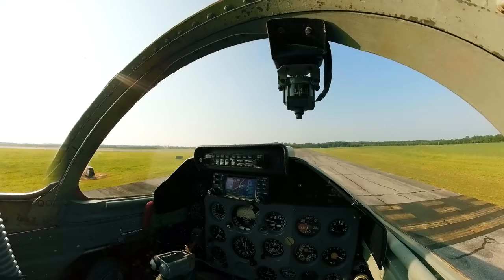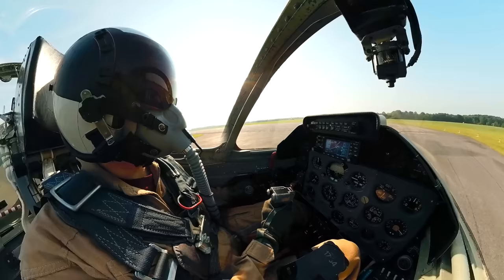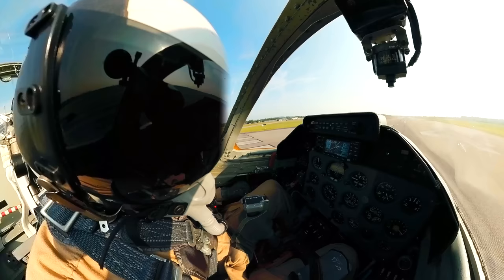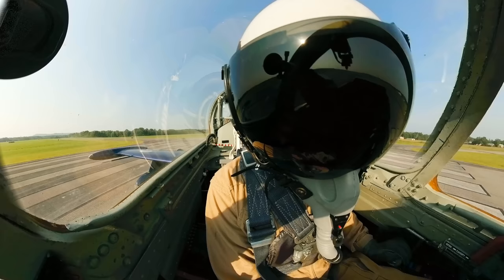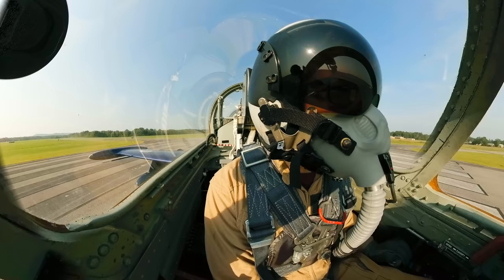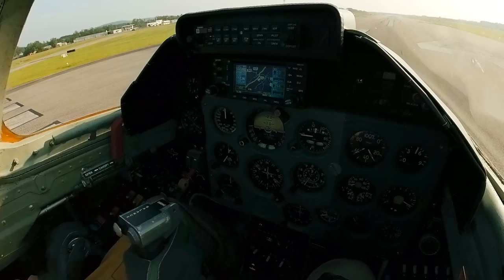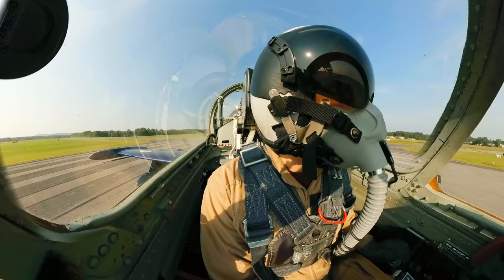What is the pressure when you're pulling the handle on the stick? Handle's just under 40 a side even. I used the emergency brake for a second and it seemed more effective than a full pull with the handle. It seems like almost all the braking is just the last 10% of pulling the handle. Maybe it's just the handle - full is effective enough and I just adjust it so you get more braking sooner.